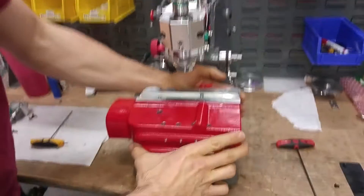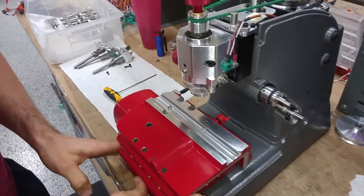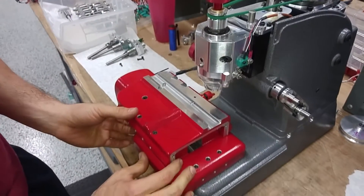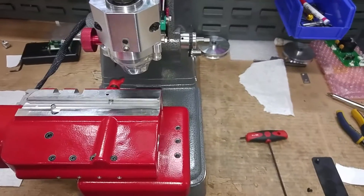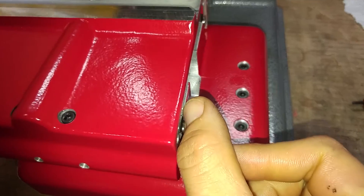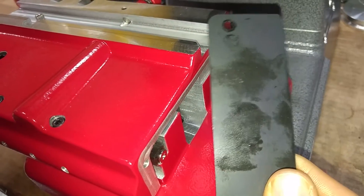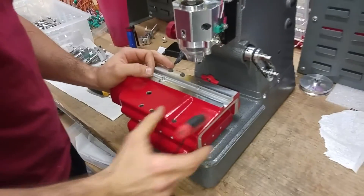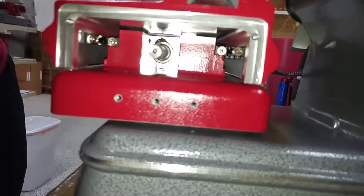At this point we should now have much freer motion of our table. Depending on how it feels after you speak to your tech support, that will determine how you're going to go. If you all think this is the cause, you'll continue forward. What's probably going on is the table is stopping and not allowing full travel to the left side. Your table should come over far enough to where the ball screw end actually sticks past the end — that's the perfect position. That's why we removed the end cap, to get this motion. Once this is over, you know your table is over far enough. If that's not happening, we need to loosen these four screws right here. Looking in from the side, you can see the bearing assembly.